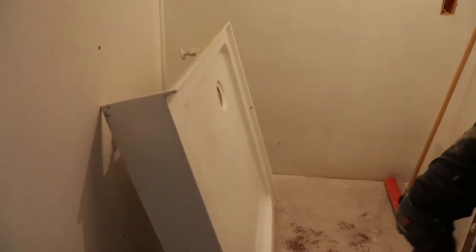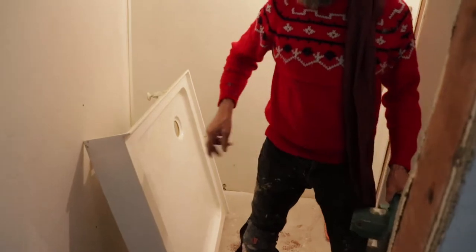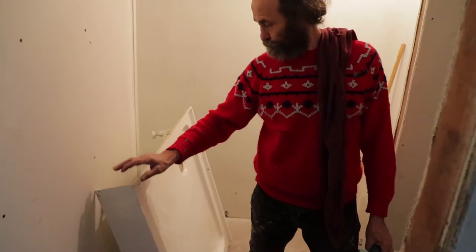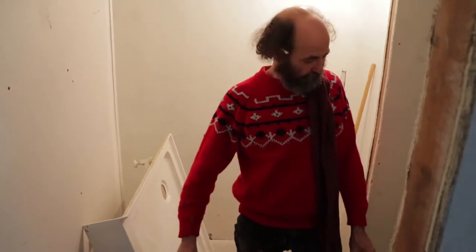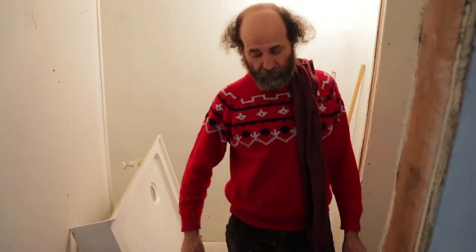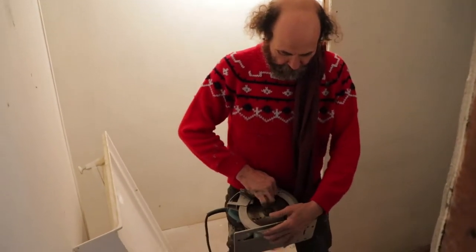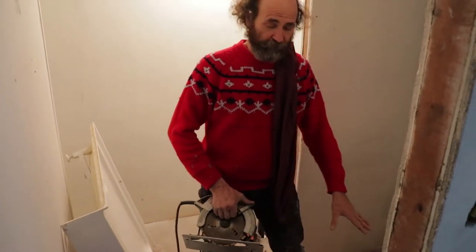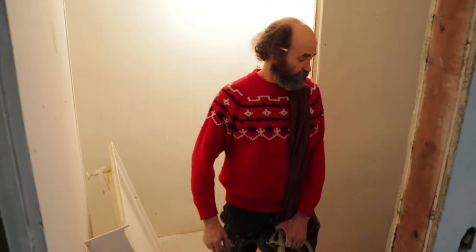It's short, nice and clean. This is the shower base right there — it is a good size, 38 by 38. I'm gonna cut the hardwood in here to remove whatever is on the floor. We use the old Makita, set up the depth just to cut the floor so we don't cut anything else. Once we cut this hardwood floor we're just gonna remove it.